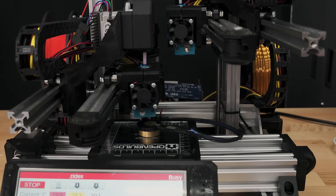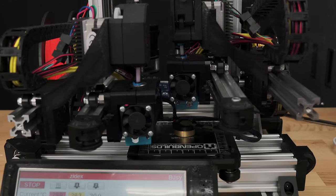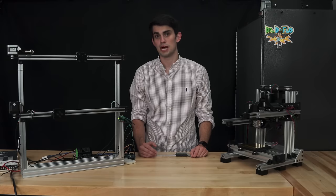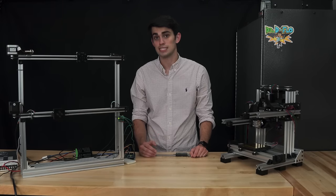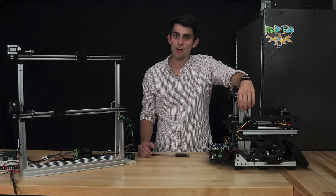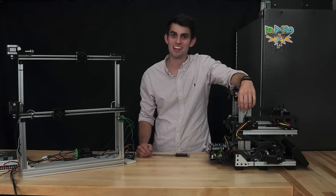The extruder is then brought down to touch either the build plate or the force-sensitive resistor directly. This process is called probing, and the force-sensitive resistor would be called the Z-probe. There are different probe types, just like there are different limit switches. A Z-probe is not absolutely necessary, but it can be used in addition to or in place of a Z-limit switch. It's time to discuss the puppet master for all these components, the printer motherboard, or as the cool kids call it, the MOBO.